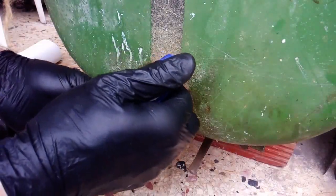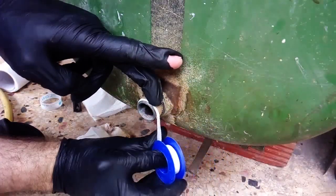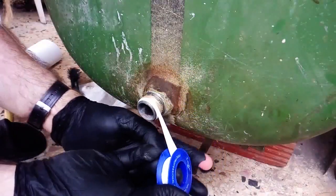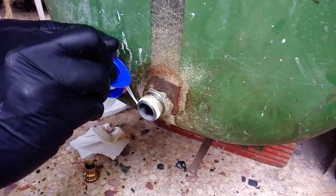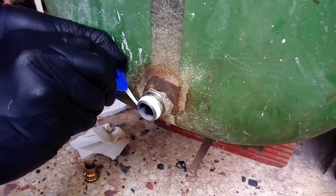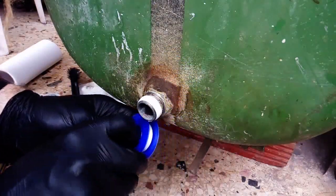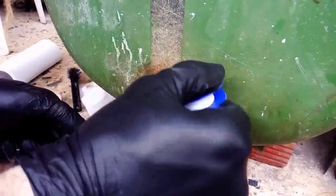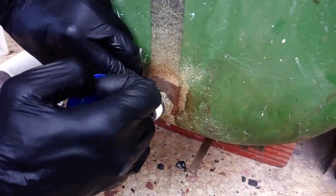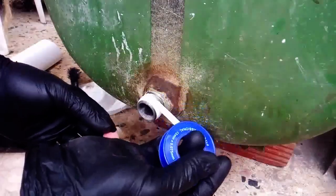The next part is applying the PTFE tape. For the first few turns I like to make a rope of PTFE tape and fit it into the first empty threads of the pipe, inserting it into the thread, so the thread will have a soft material filling. This helps the fitting slide into position more easily as it's screwed in. I slowly work my way upward, keeping the PTFE tape vertically and not parallel to the fitting.